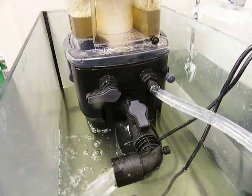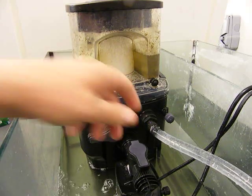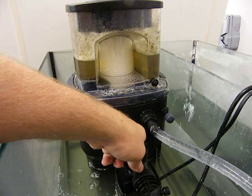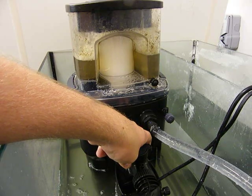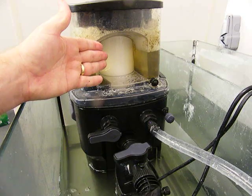Adjusting the Sea Skim is quick and trouble free. Using the foam adjustment lever we regulate the foam height, which can easily be set using Red Sea's patented Foam View window. This window in the collection cup doesn't block up with protein and makes foam adjustment really simple. You can see that just by adjusting the lever we can easily adjust the height of the foam.